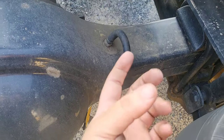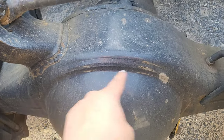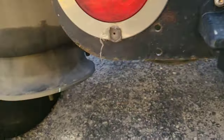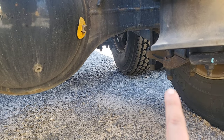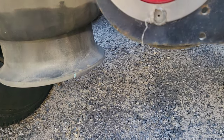When I put the stinger down I can just go right in here and hook up. For example, if I wanted to hook up to this differential I would put the fork here and I can lift the truck by these two sides with the forks. But I always have to make sure I chain up this axle so it doesn't sag down. You can also tow from the bolts here - there are these cups that go right inside there, and you just chain it down. I'll show you what those look like right now.